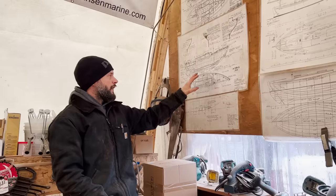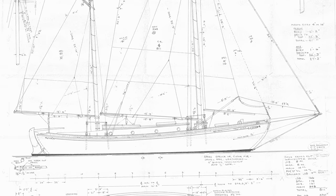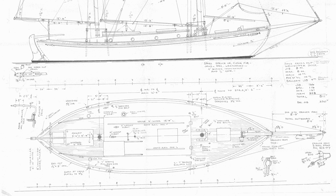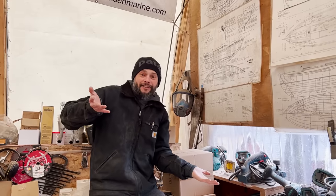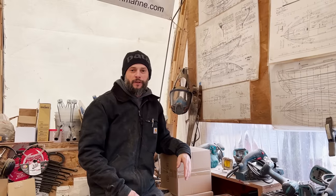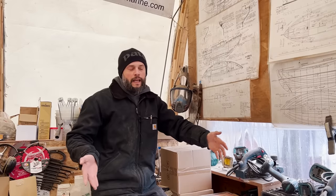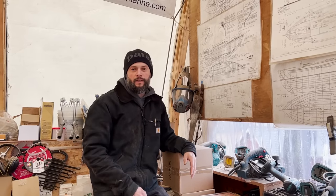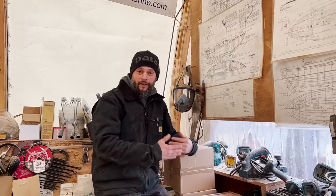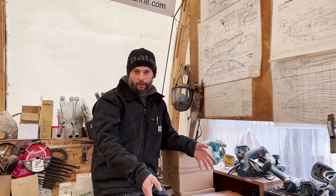But in reality, you've got over 9,000 pounds on the keel, and on a boat that is as big and heavily built as Arabella, if you were to walk from one side of the deck to the other, it shouldn't make a big difference. You're not going to suddenly dip a shear 6 inches on one side. The weight of one of those fuel tanks is no different than having two people sitting on one side of the cockpit or two people balanced on either side. If a couple people's weight is negligible, then that will be negligible. Where it does add up is if you had 20 people sitting along one rail, then obviously that would be an issue. And that's the same as if we put all of the weight on the boat on one side.